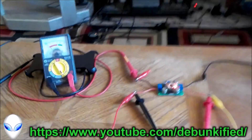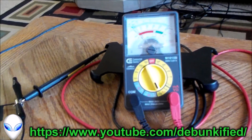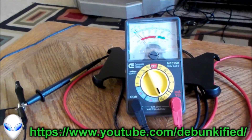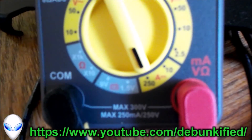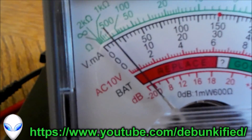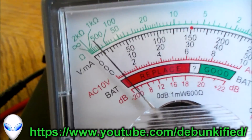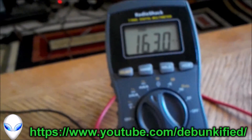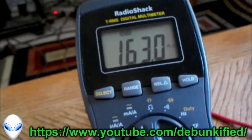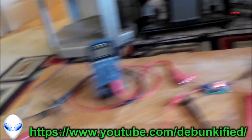I also tried an analog meter on the input here and it shows pretty much the same thing as what a digital meter would do. I believe this is about 15 milliamps — this is on the 250 milliamp range, so I've tuned down the converter. As you can see there it's about 15 milliamps, a little over 15 milliamps or so, while the output is still 163 milliamps. So I did tune this down so I wouldn't blow the analog meter.